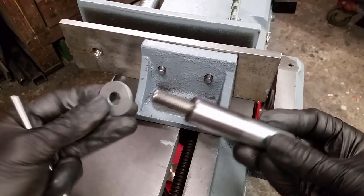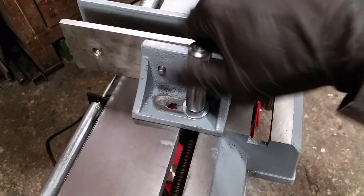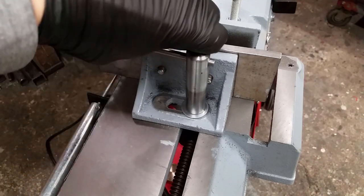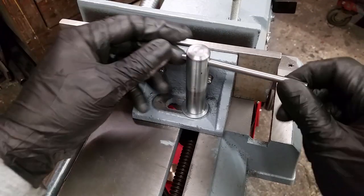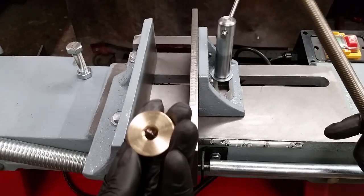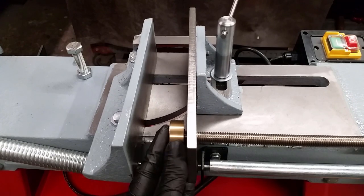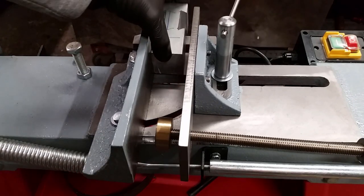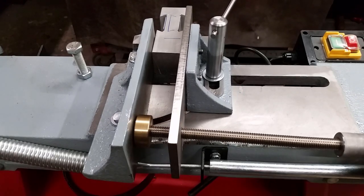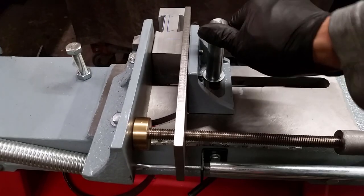Time to assemble the new clamping bolt. The handle is just a piece of 6mm high speed steel right now — maybe I will build a nice handle with stops at the ends, but I kind of liked the possibility to remove the handle completely. Let's see if everything works as imagined. The threaded rod with a brass cover will serve as a machine jack to securely clamp shorter parts in the vise. When everything gets tightened and clamped, the part shouldn't be able to move in the jaws.